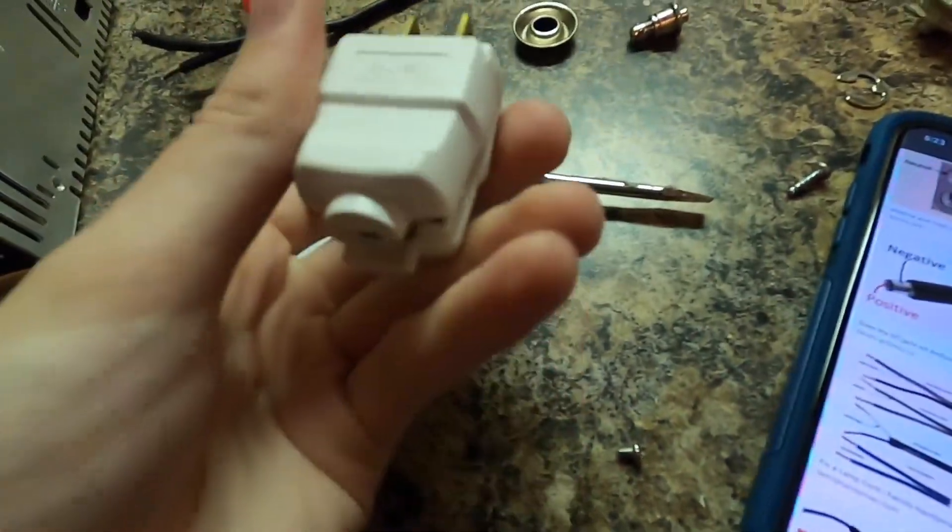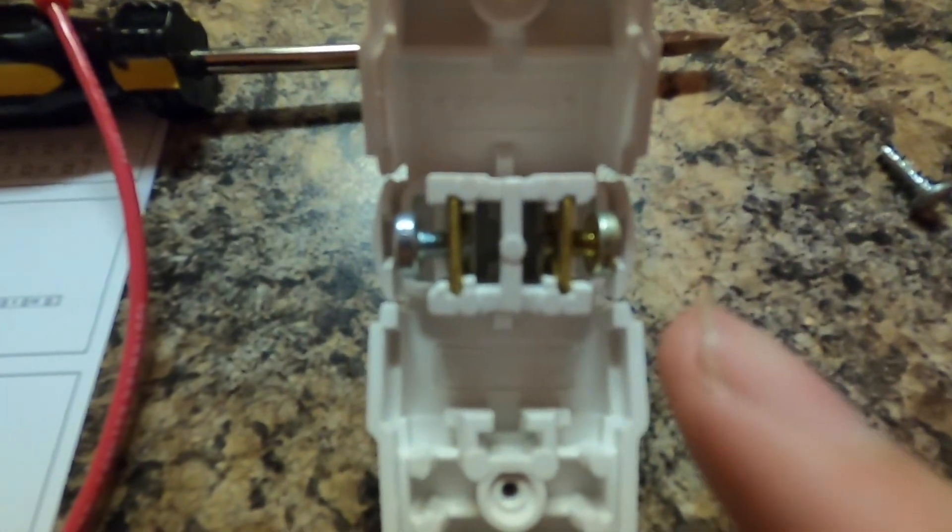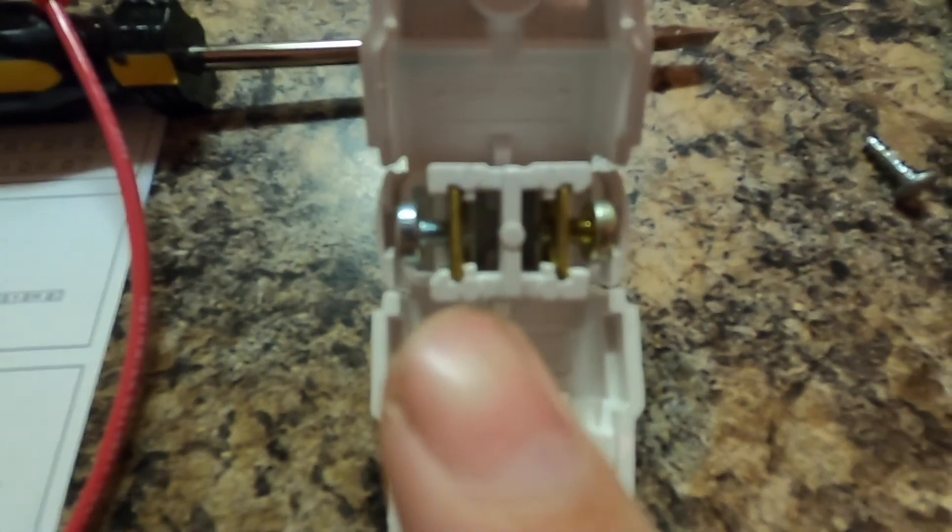Y'all need to hold me responsible — say hey, we need the headlight done. This is the main thing: I can solder, I just can't test how well that solder is without power. I need the power to test the lights so I know what I'm doing right and wrong. So this is the first step — we'll make a power plug right now. It's just a two-prong because I think two is enough. The main question I had is whether there's a positive and negative on the plug, and it turns out there is. The gold screw is your hot, which you can think of as positive.